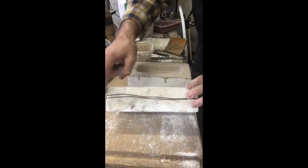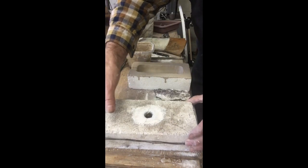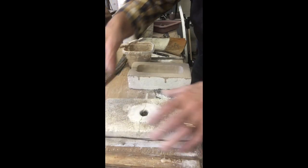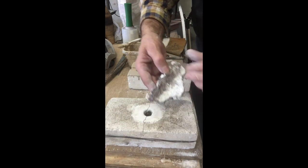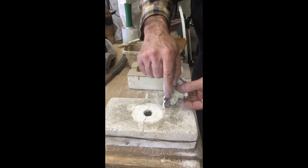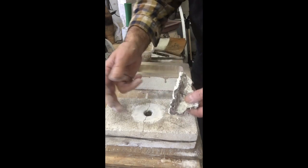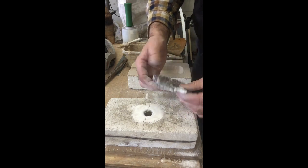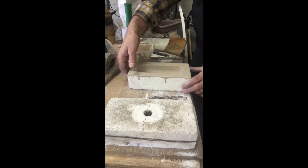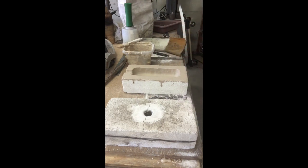You'll notice the top is wired — just a couple of wraps of black wire, twist-tied. It's going to crack from the heat, but I didn't want to add a lot of weight with a steel band, so this makes it a lot easier. You can see how the flux penetrated the firebrick on a worn crucible. I had to break the last one out of the frame to remove it. By cleaning it and adding additional kiln wash, it'll last a lot longer. I got at least 15 or 20 pours out of this system — well worthwhile.